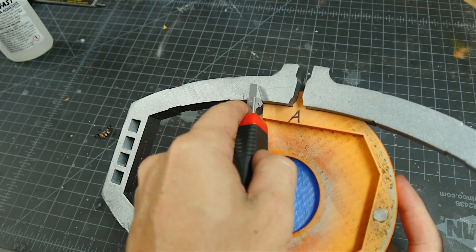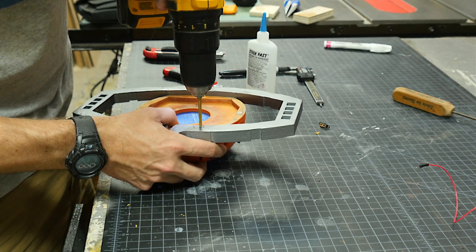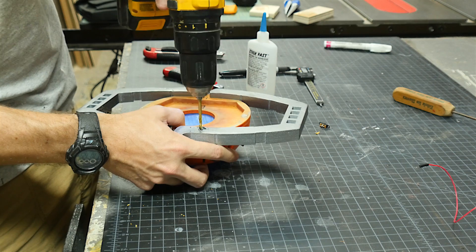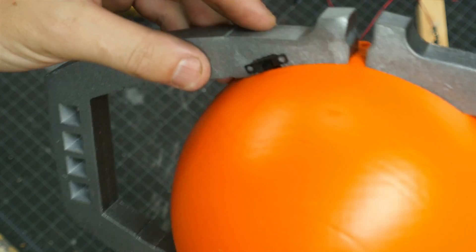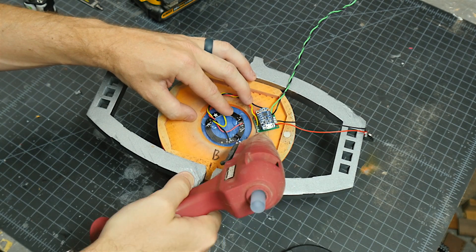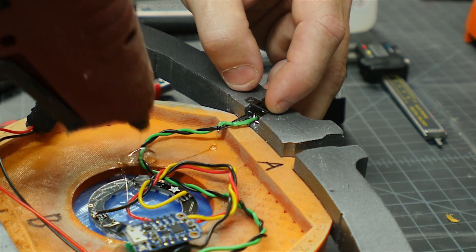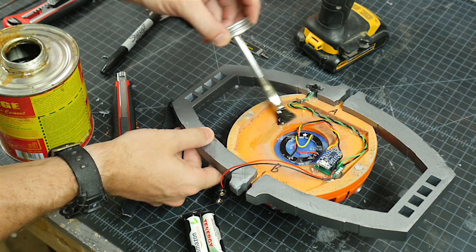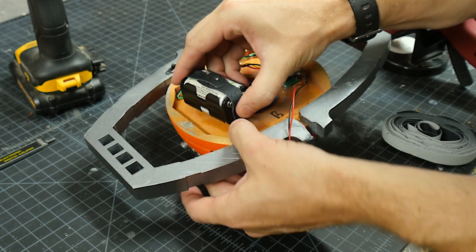It was super cool. The last thing to figure out was where to put the switch, and I decided to put it on the handle right on the outside of the dome on the back. I traced the outline of the switch and then used a sharp knife to score that line. I used a drill bit to quickly remove a lot of the material — I really wanted to knock out a whole section so the switch would fit right down on the inside. I did a few test fits and cut out a little bit more material to make sure there was room for the wire to run through. Then I set all of the electronics in place on the back side and used hot glue to hold everything there. Hot glue acts as an insulator for the electronics and makes it really easy to pull these out in case I ever need to redo or replace anything.